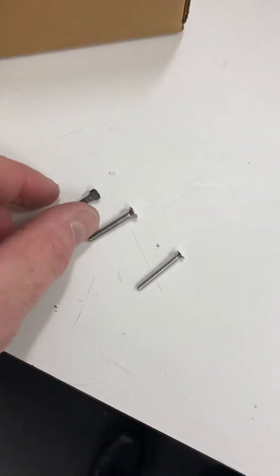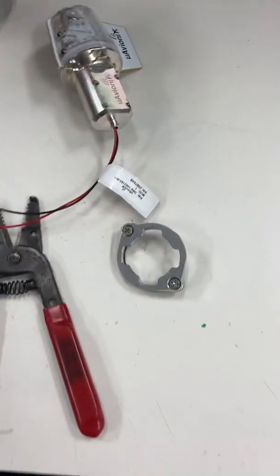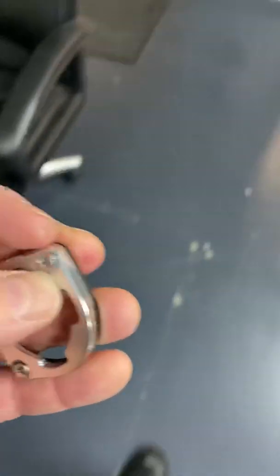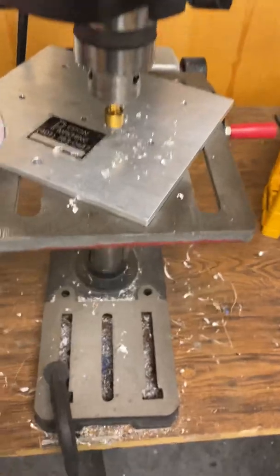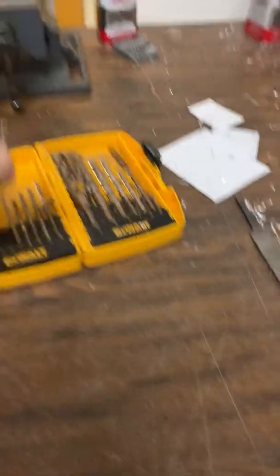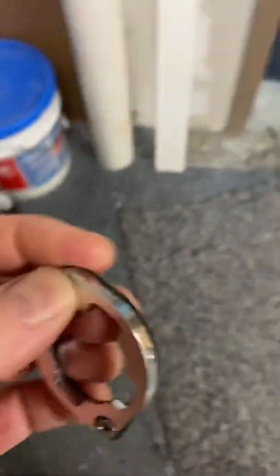This is another number six screw that I provided. The screw was too small for my airplane, so it turned out the mounting plate had to be drilled out. What I had to do was drill it and actually counter-bore it, because it's a very tight fit. The tail beacon fits in here very tightly, so I used this drill press to counter-bore it. After drilling it with a standard drill, I used this counter-bore — you can buy them at Lowe's. That's what had to be done because the fit was so tight.